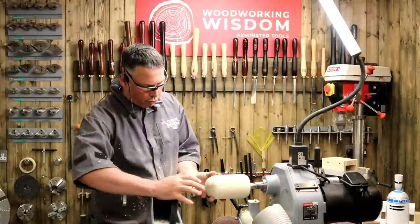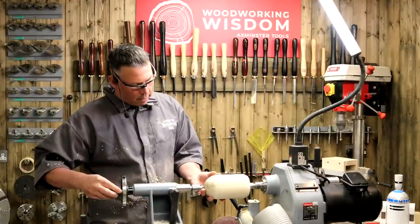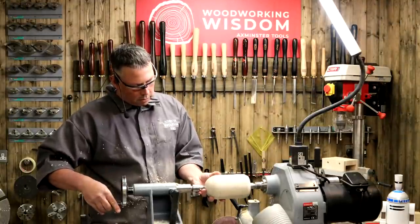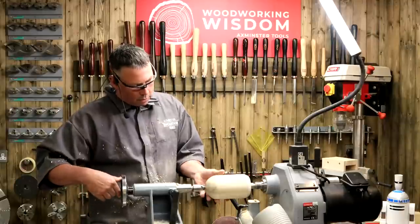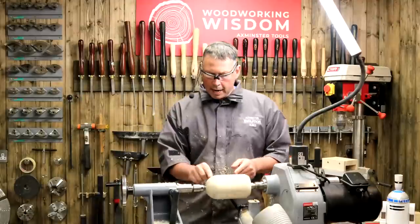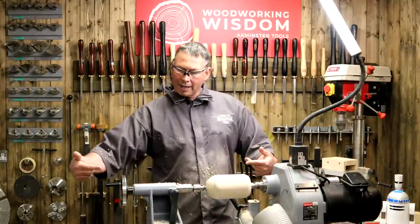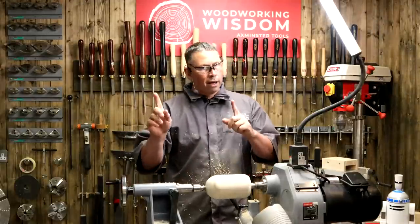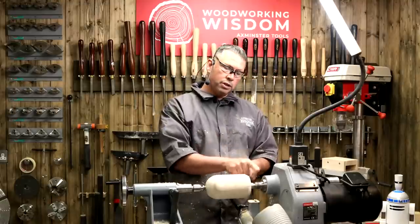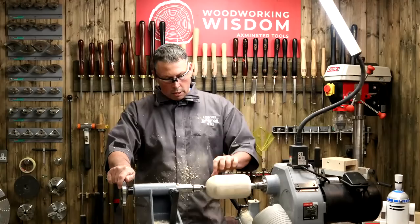It's fitting onto the ring of the ring center that I was using already. Oh, there we are. That's fitting in nicely. So now I've got a live center supported by its outer ring. I can now send the auger all the way up through the middle until I get to just past halfway. Once I get to that point, I'll stop. We'll change the center on this side, flip it over, and finish the hole around.